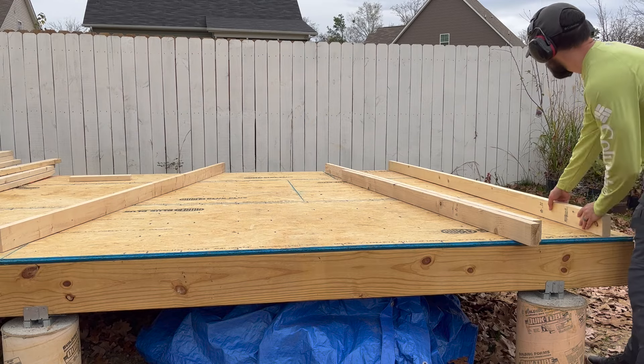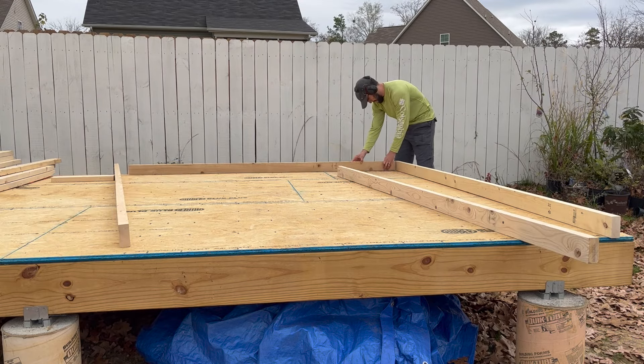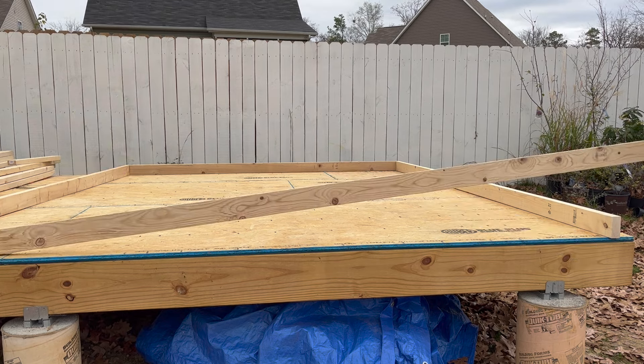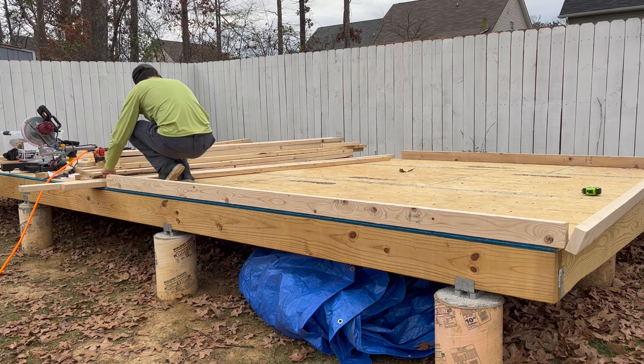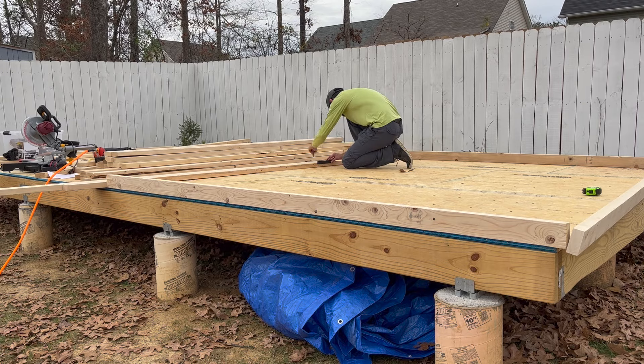I opted to build these walls all as one unit, with the stud at the back being eight feet tall, the stud at the front being ten feet tall, and all of the studs having an angle cut into the top that matches the slope of the roof. I'll put in the description how I found the slope of the roof, but I did use it here along with a little bit of trig to mark where the tops of the studs should be.